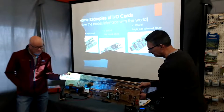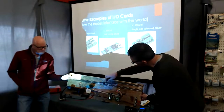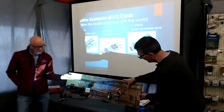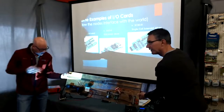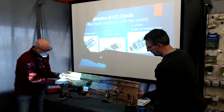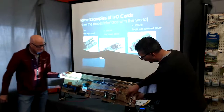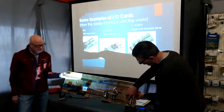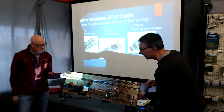But that's detecting current on the entire length of the track, or in a certain section? Well, I have gaps cut in, so I block here, block here, and then Jerry's block over there. And those would be our normal feeds to the track? Yeah, this is just your straight DCC. Notice there's nothing really touching. These CTs just pass current through, and the DCC system is totally separate from LCC.